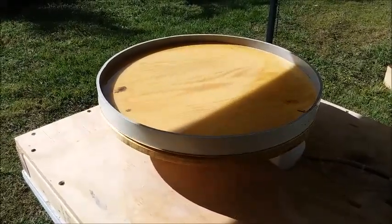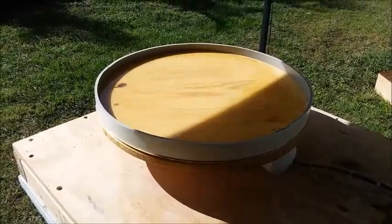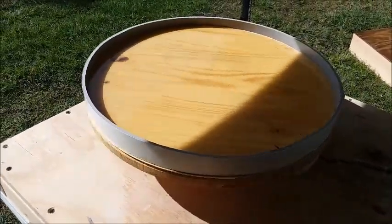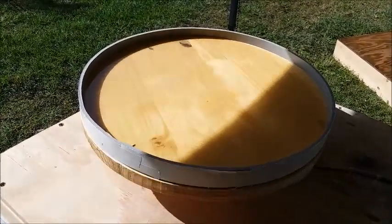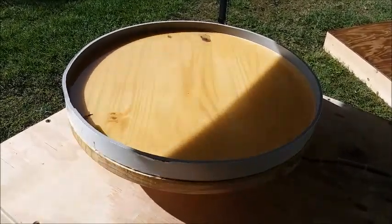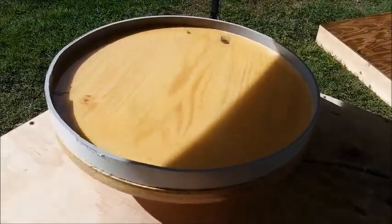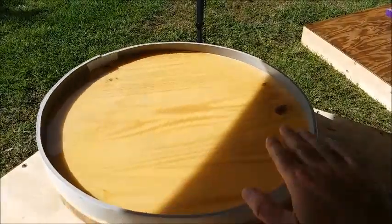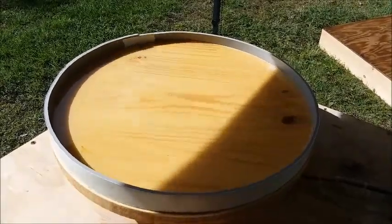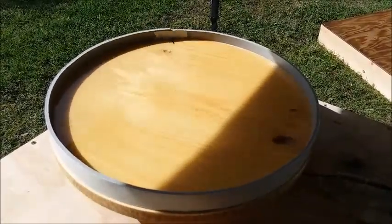This is exactly the rate I want. This should give me an f3.5 curve at 16 and a quarter inches in diameter, which is what this mold is for. It's going to be for slumping 16-inch mirrors — a master concave mold from which I will turn out production convex molds for slumping mirrors in my kilns. I need to pour some resin in here and have it take on the correct parabolic curve from the centrifugal force of the rotation, then harden up.